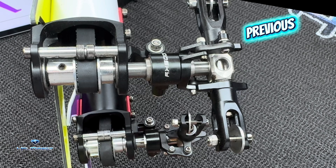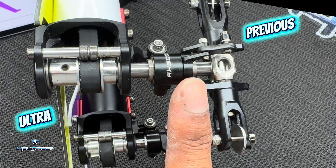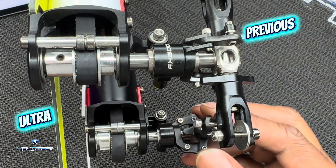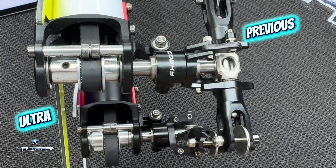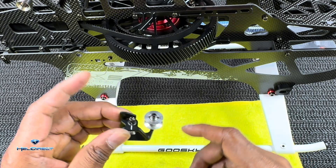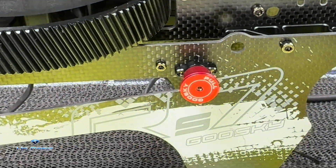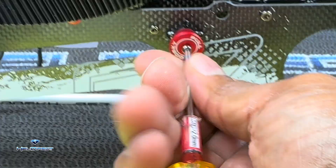Here we have the regular RS7 on top and the Ultra down here. You can see that the shaft is a lot longer on the regular RS7. Also the belt guide here is off to the side a little bit on the regular, while it's completely centered on the Ultra — thus the shaft being shorter. And I think they made a different pulley back here; as you can see, there's less meat on this side. This is the belt tensioner that goes on this side of the frame — it goes into these two screws, bolts down, and puts the tension on the belt. This comes assembled in the kit, but you want to make sure you take that screw out, put some Loctite on it, and make sure that is tightened down pretty tight.